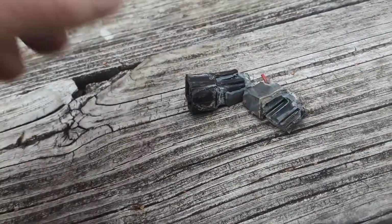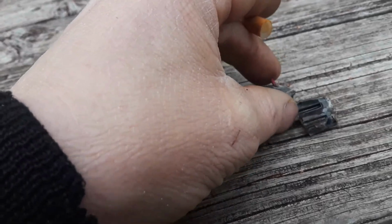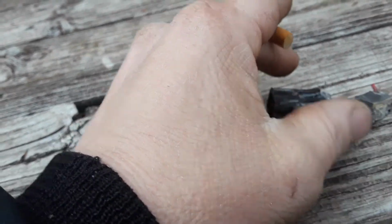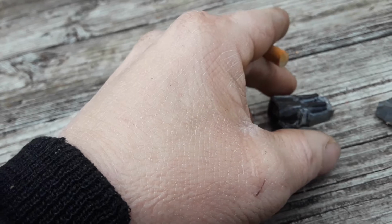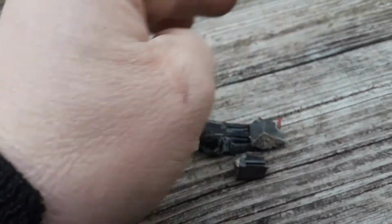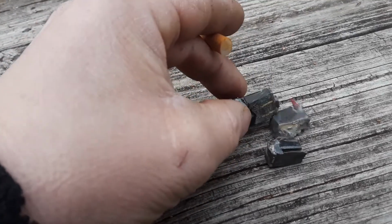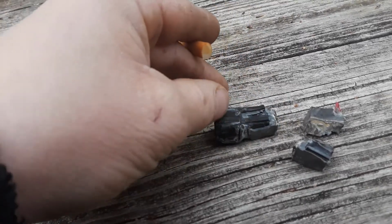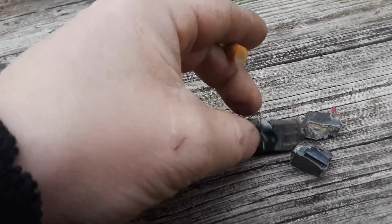It's just like a little mini brain, and all it does is it's got a ground, and then it's got this circuit board, and when the safeties are applied, it knows, and it'll allow the machine to work. And when they're not applied, it sends a signal and then it just grounds out at the engine, and that's all it is. But they're going bad left and right now, and they don't make them anymore. I don't know who made them. You probably could have them made or find someone that makes them, but that's all it is.